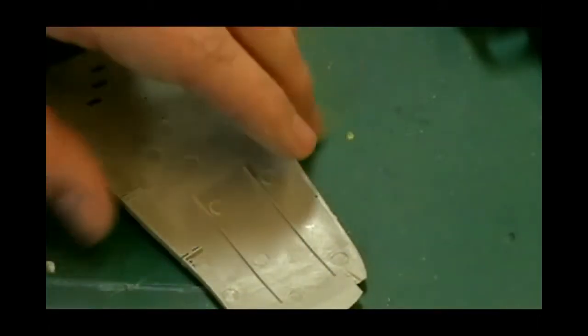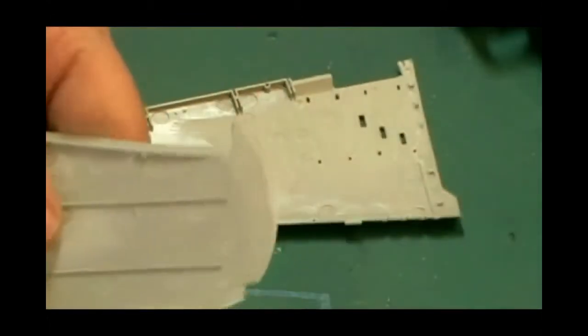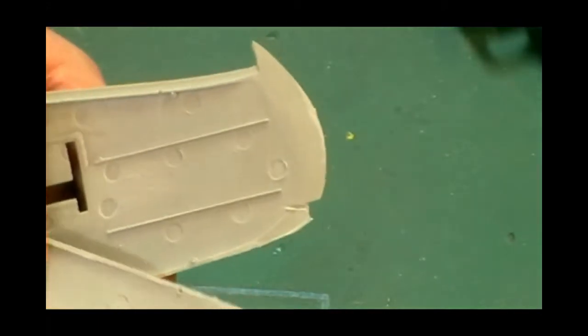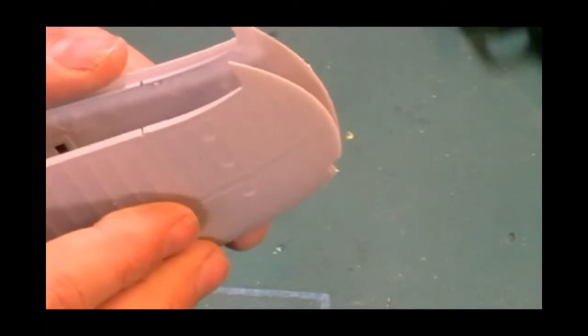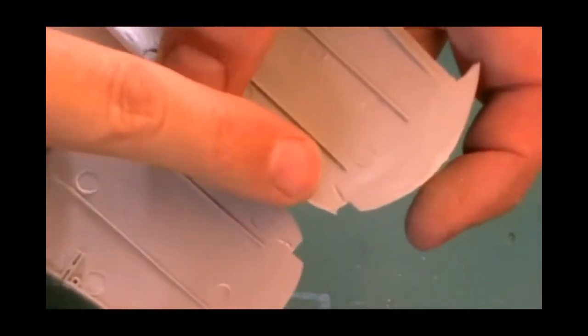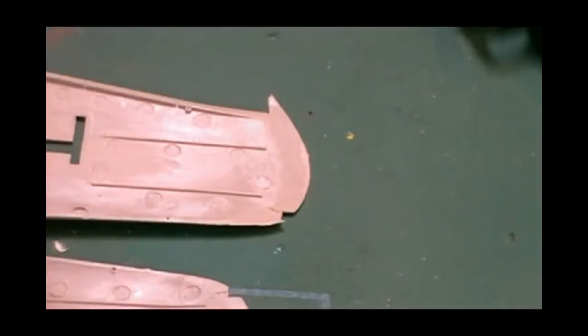The thing with ours is that we're going to have working LED lights in the end, so what I've actually done is installed a little groove area to get the fiber up. You might be able to see we've got this groove here — there's a groove in the other one as well. The easy way to do that was to pop them together just for a moment, then come in with a drill bit and just drill in. That scraped out these two grooves, and we can make them a little bit nicer if needed. I wanted to show you roughly how to get them chopped out and sanded in, because they're not an easy thing to do by any stretch.